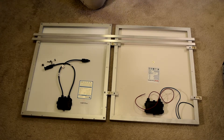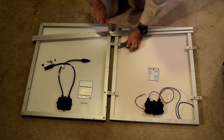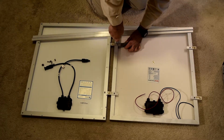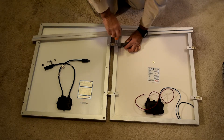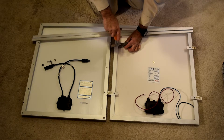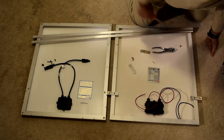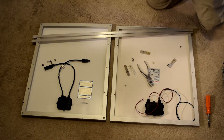Now I'm going to take the existing tabs off so that I can free up those holes. These are number eight stainless steel machine screws, not self-tappers, and I have lock nuts on these. There we are — first one's off. All right, those four tabs are off.